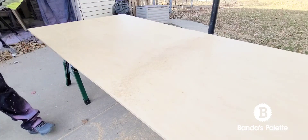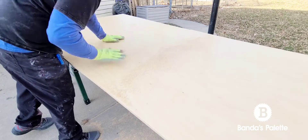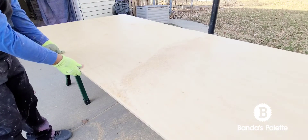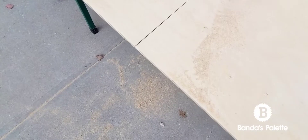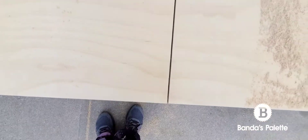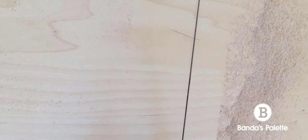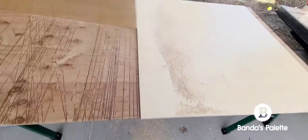Because I referenced the T-square, I know my cuts are going to be at 90 degrees. I actually use this instead of the factory edge, because sometimes when you buy sheet goods from a distributor, the edges of the plywood get dinged up from banding or constant moving.